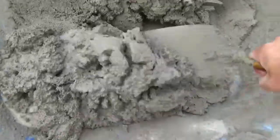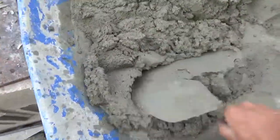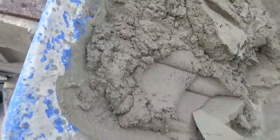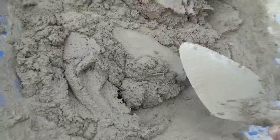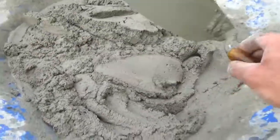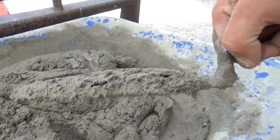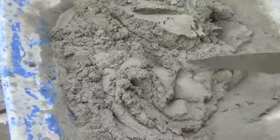It's just a matter of experience — I've been doing this 30 years. So you can see this mud here. I loosened it up pretty good, and this is my parging mud — what I'll parge the wall with and the back of the stones. You can see it's totally different. It's not holding its shape. You shake it on the trowel, it flattens right out. And when you plop it down, it's loose. So that's what you want.